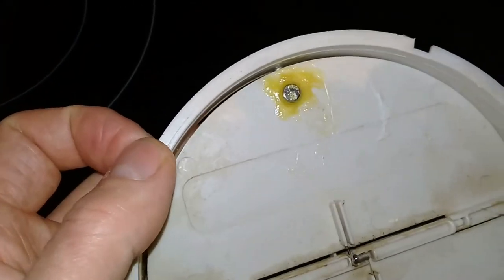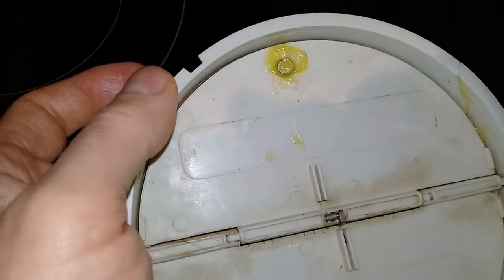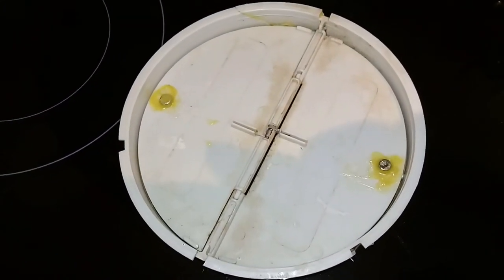What that gives you is a good close of the flaps — it takes a certain amount of pressure to blow or suck them open. With the cooker hood fan on speed one, one flap opens, and at any other speed both flaps open. The pressure builds up and they open, but what it doesn't allow is the wind to suck the flaps open and have them rattling all night.